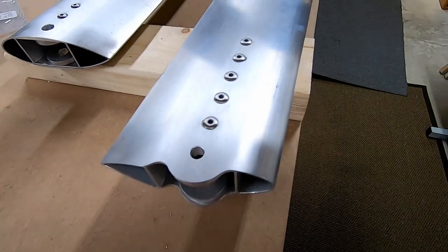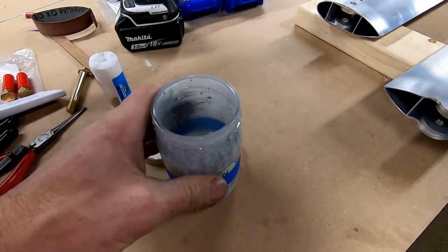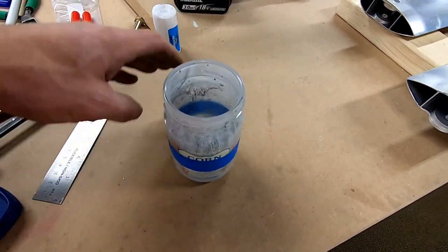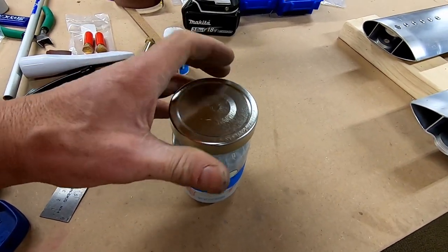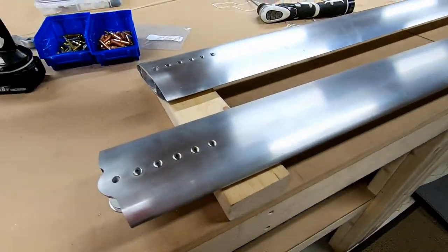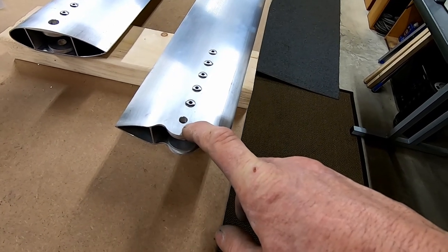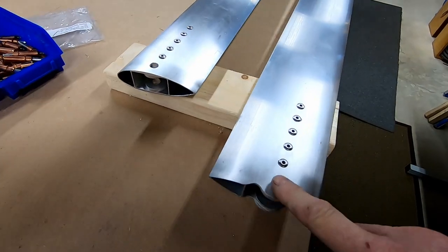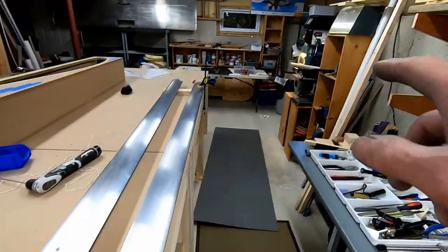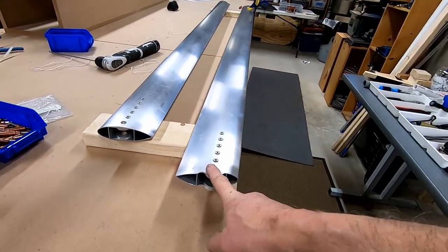So that's 5 times 8, so that's 40 of these you have to put in. What I did here, just to minimize the stink inside, is I went outside and sprayed a bunch of the self-etching primer into a glass and then dipped the rivets in that. I just kind of went over it with a Scotch-Brite pad. Now I've got to drill this out to seven-sixteenths — I did this one already. Pretty much the only thing I can do is clamp this on here; I have no way of getting that into the drill press, so I'm just going to do it by hand.